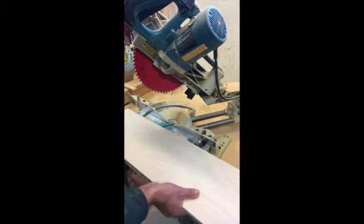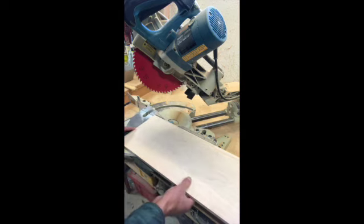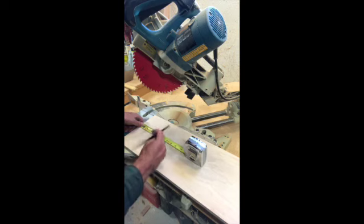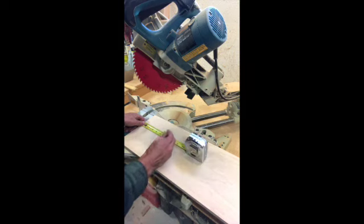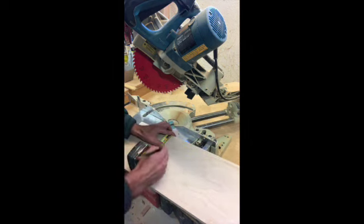To make the gable ends, you start with a piece of 9-inch wide stock. This could be plywood, it could be solid wood. Knotty pine works pretty well. Plywood would be fine. What I do is I simply make a single mark, and we want to go 7.5 inches to the peak. So I measure out 7.5 inches, and I make a mark near the center. Then I measure exactly 4.5 inches from the edge, and I make a mark, a single point.